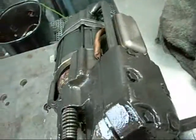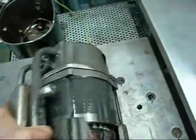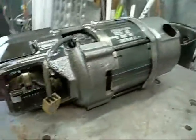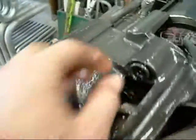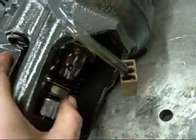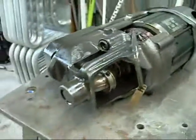So either that spring goes or it would eventually leak and spew oil and gas out everywhere. I don't even know if Copeland make reciprocating compressors anymore — it wouldn't surprise me if they don't, especially with the success of their scroll compressors, which really are a nice little unit. That's what killed this one — busted spring, then vibration damage from there on out. Everything else is fine: the bearings are fine, she turns over nicely, and it does pump pretty well when you seal up the discharge. So there you have it.